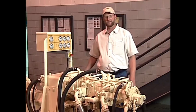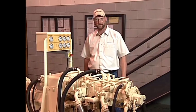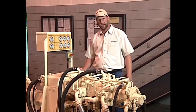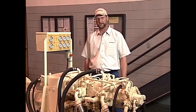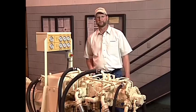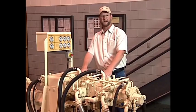Let me begin by describing how we get the power from the chassis to the hydraulic pumps. From the main driveline on the chassis we send horsepower into the PTO gearbox. This gearbox then, when we put it into PTO, sends the power to our main hydraulic pumps.